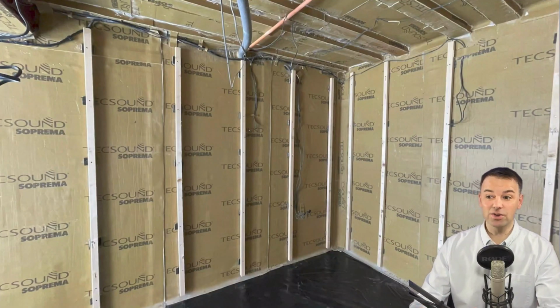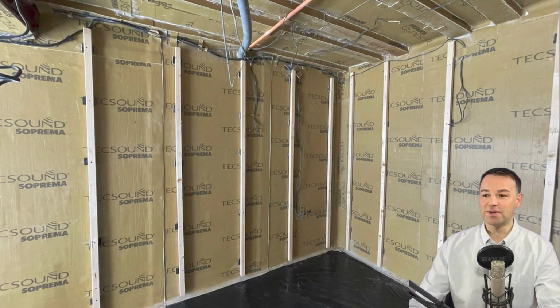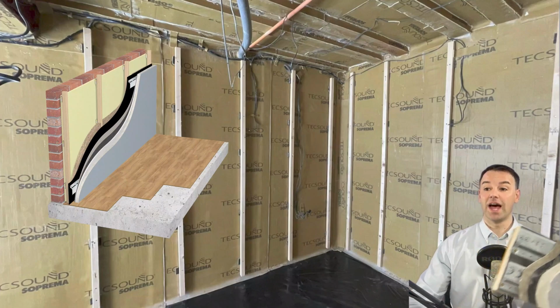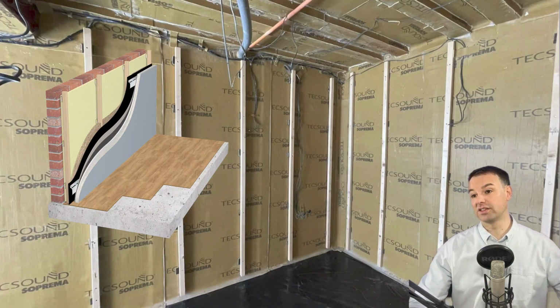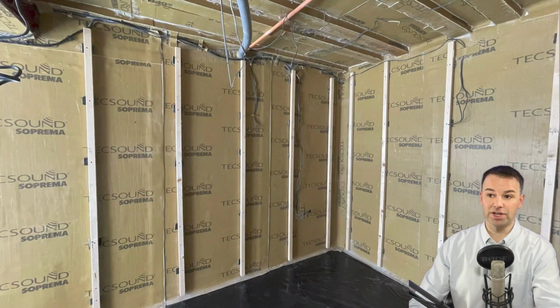Because it's only a single garage, and for you guys in the US and Canada, this is the size of a single garage in the UK. Not very big, right? But we only have 100mm space to play with. We're going to be installing this 95mm thick system. And the next layer after we've sound deadened the walls is these battens, which we install on anti-vibrational pads.